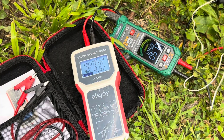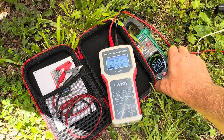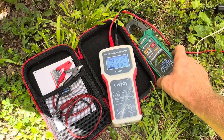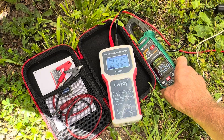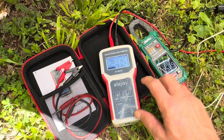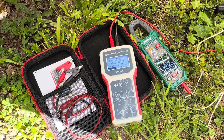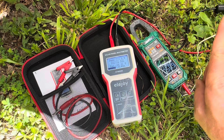About a half hour past the original test, it has warmed up outside. The ambient is now 91.2 degrees Fahrenheit. The panel temperature, rear of the panel, is 138 degrees Fahrenheit — 58.9 Celsius. I believe that is fully heat soaked. So I'm going to get a completely hot panel tracking right here under mostly clear skies. It's got a little water vapor, so bear that in mind. 239.4 watts — 90-degree-plus ambient. The panel's been outside for well over an hour, hour and a half now. With mixed clouds, the module temperature is pretty warm and we're still well above the nameplate rating on these CalSun panels. That's pretty impressive performance.